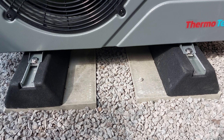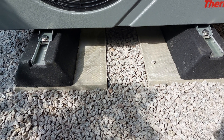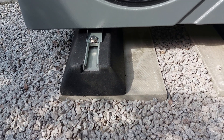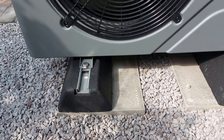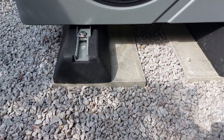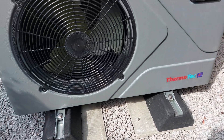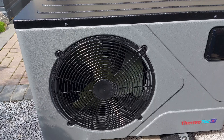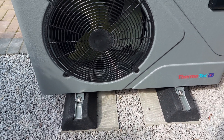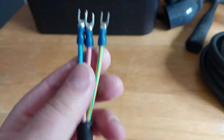The base for this pump is just a couple of 600 by 300 concrete slabs set in some concrete themselves to level them up, and then the rubber anti-vibration damping feet. They're available separately from a plumbing supply — about £15 each — just to stand the heater up off the deck, get it clear of any snow, and provide some anti-vibration damping.